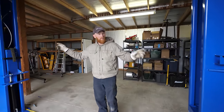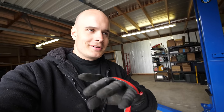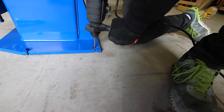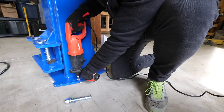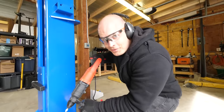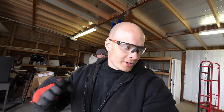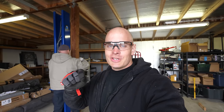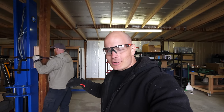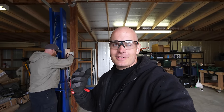We'll trace the plate, get it out of the way, then start running cables and all the other components. We just placed the plate down to make sure it would fit and that we haven't messed up any alignment. After drilling a bunch of pilot holes, we found that the concrete thickness is not uniform — we were going to risk it with the 4 inches since that's what it said on the website. But my concrete is not four inches, so we are going to double the price of this project and replace the slab. It's better to be safe than sorry.